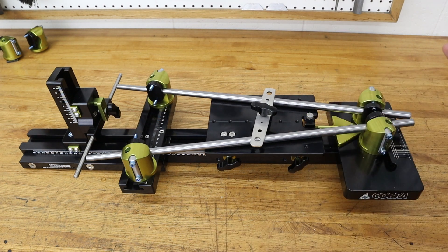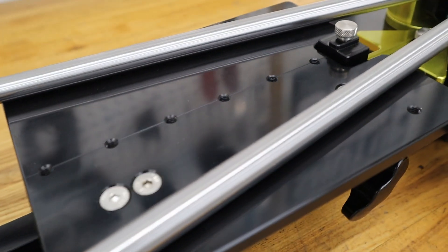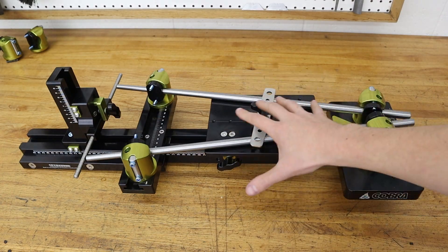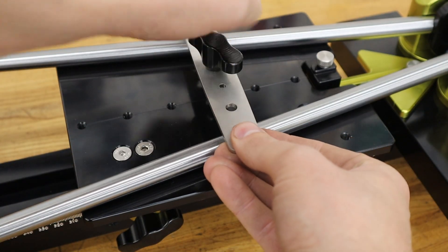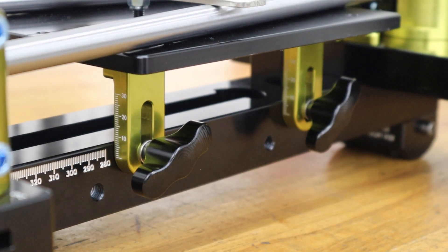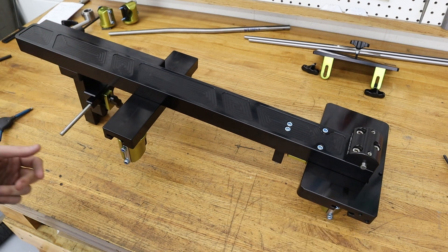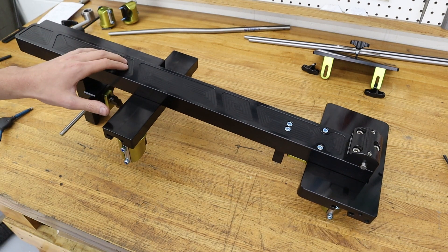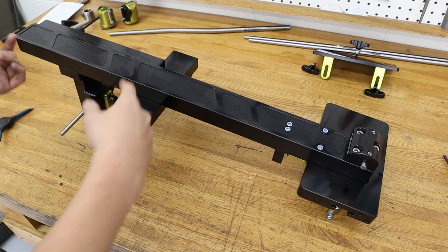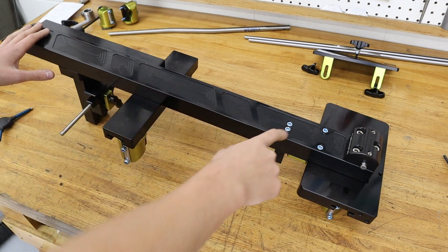That's the primary function of this table, but frame builders are creative — with threaded M6 holes and a centerline, you can make laser-cut or 3D printed attachments to hot rod it for your own purposes. The fixture table legs are laser-etched with millimeter scales so you can repeat or document your setup. On the back side we CNC machine these recesses — I call them hot pockets — they look nice, and since this tool could last for decades, what's another minute of cycle time?